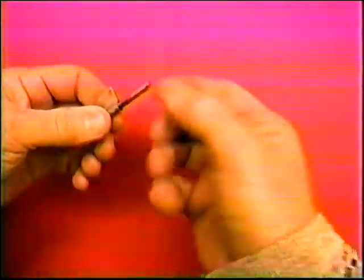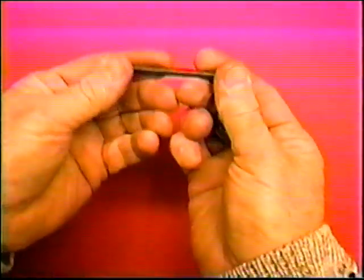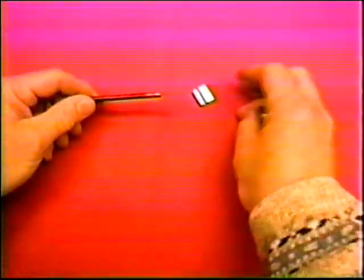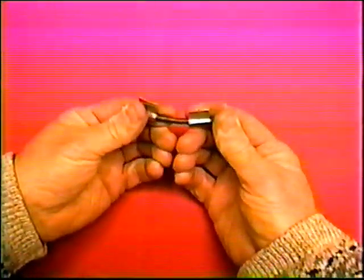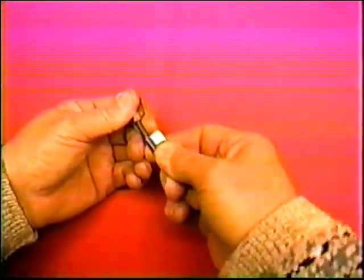This is a part of a tool that Warren came up with also. And what it is, it's almost like the thing they clean drains with. It's a counter-wound spring. In other words, it's a spring inside of a spring. Now, there's only one trouble with this. When you mount this, and I have a little test jig over there, when you mount this and put in the angle that we need to bend it on, the side load is so much that the friction just completely destroys the movement.